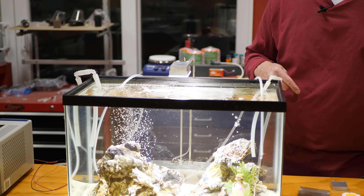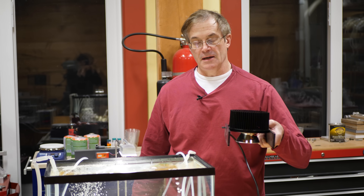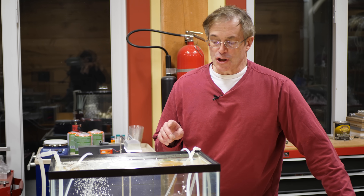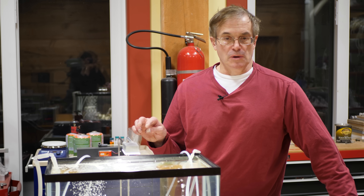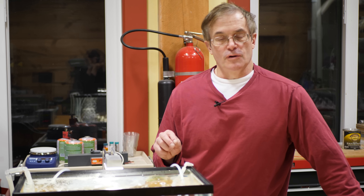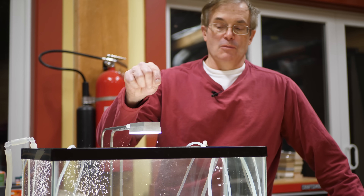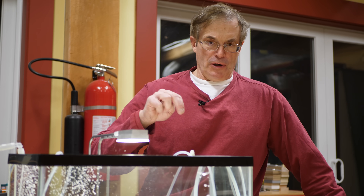This particular light, which is obviously far smaller than the old light, actually has two of these 20,000 lumen LED chips in it. In addition, because it's using water cooling, it can keep the chips at a lower operating temperature, and therefore the chips will actually produce more lumens per watt — they're actually more efficient. There are some other advantages to being able to remote the heat besides producing a much smaller, lower-profile head. So what I'm going to do now is show you how I put this head together, which is the most significant construction part of this project.